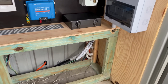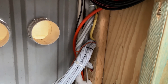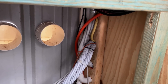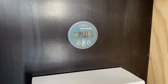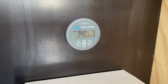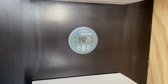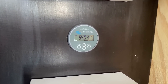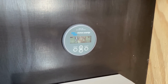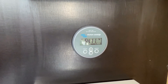I've taken the access panel off to get to that string. We'll tie onto that orange cord up the other end and bring the relay cable down from the house. The BMV unit has a relay and this can be operated on state of charge. So there's a high and low limit you can set. I'm going to use 98% as my high. So once the battery reaches 98% it'll change that relay and bring in the contactor inside, which will power the spa. Once the batteries are full that spa contactor will energize.